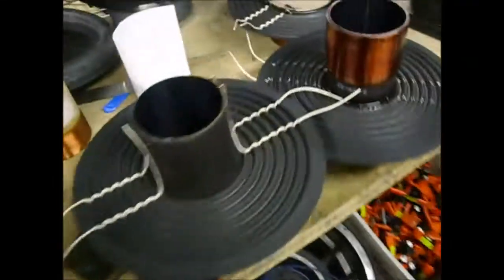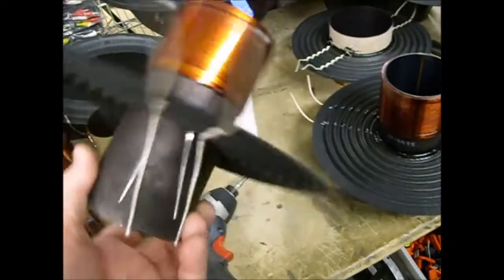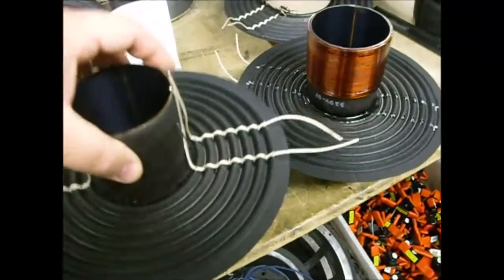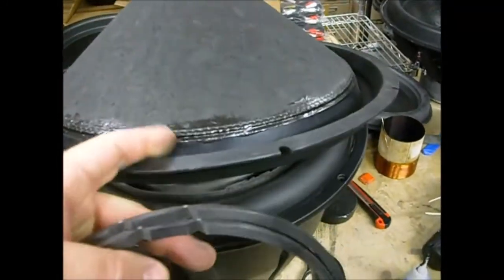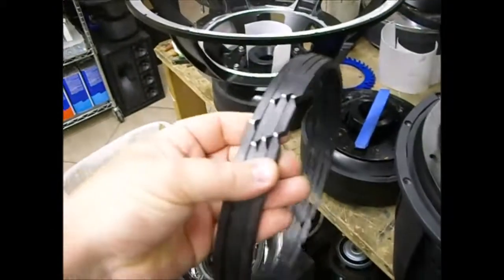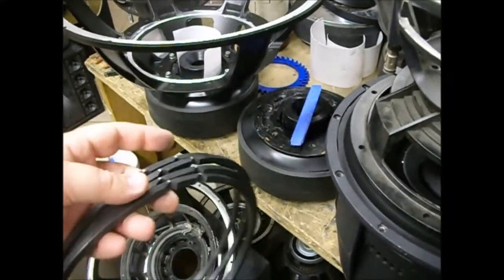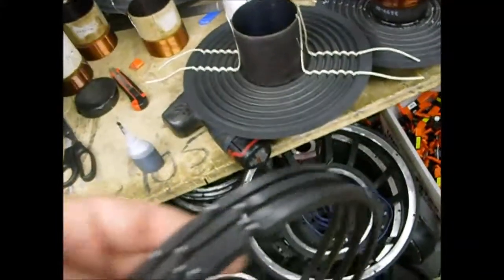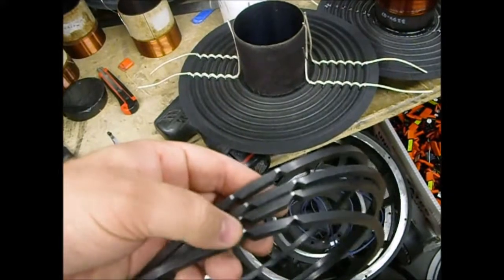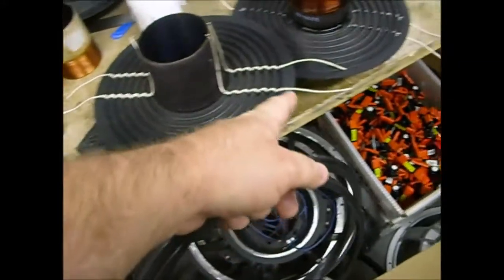Good morning — it's all cured. I'm going to build the voice coil assembly out of the frame, which gives me more control. I've taken some spacer rings. Quick note: the cone I'm using is the Blackjack cone and it's pretty deep, so I ended up using only the quarter-inch spacers instead of the full 0.65-inch spacers you sometimes see on big 18s on TI frames. We're going to do triple spiders.